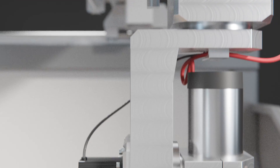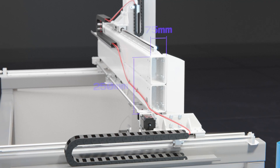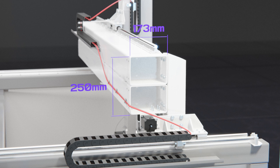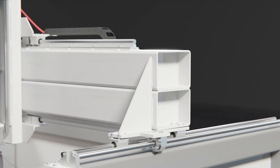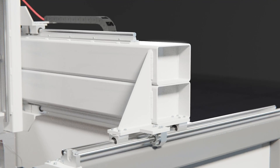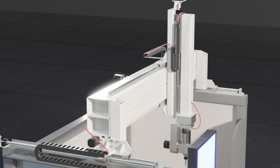The problem was that it was a really long Z-axis, and when extended all the way down, you'd start to see the gantry flexing a little too much and it would build up a resonance. To fix that, you'd make the gantry just as tall but much thicker so it's closer to a square shape. Knowing what I know now, I would redesign the whole thing with better bearing spacing, better support, and honestly it's not much more difficult to make. Another option to increase rigidity without making it thicker is to put internal gussets at regular intervals along the inside of the gantry structure — boxing it off at intervals will increase rigidity of the entire structure.